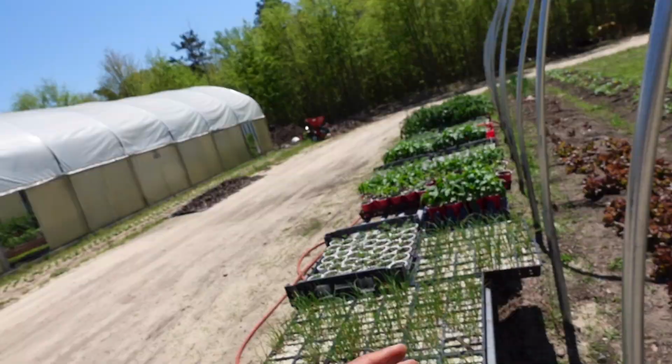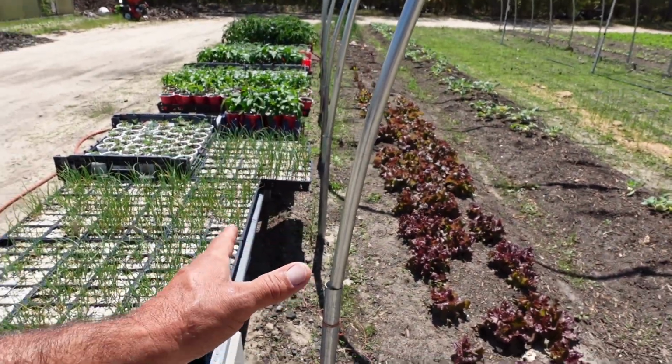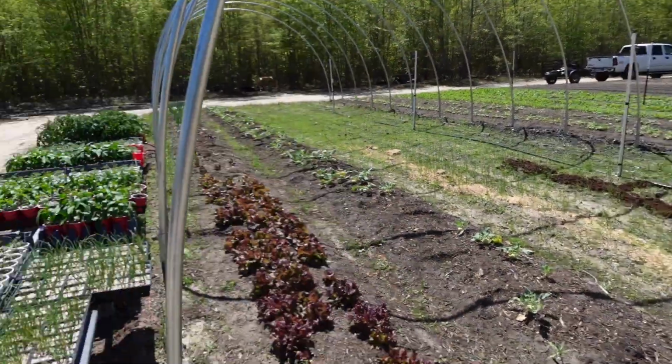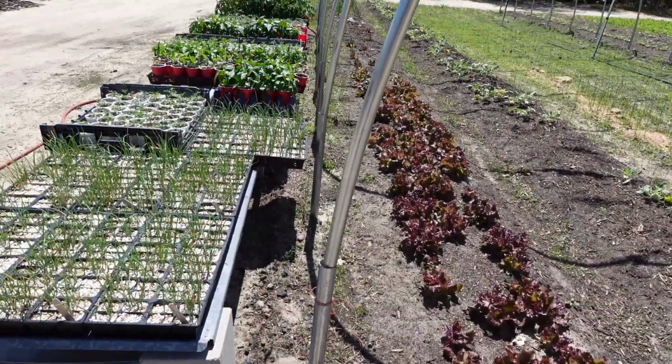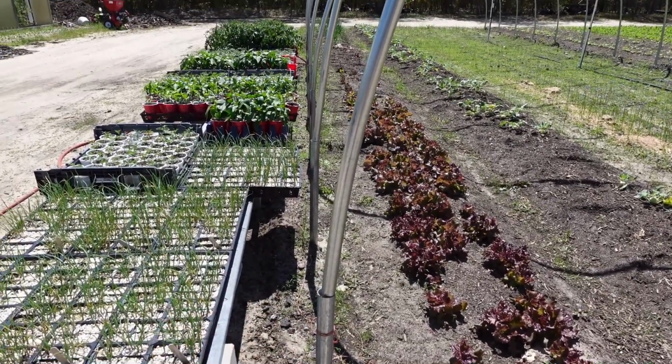There's a couple in here I'm probably going to have to go back and tweak, but for the most part, I'm pretty satisfied with it. I know the ground posts are in line. I know everything's straight there. I shot those with a transit, so I know they're perfect, both sides. And I ran a string down through there, and it's broke now, but I ran a string down through there, so I know everything from here down is good.